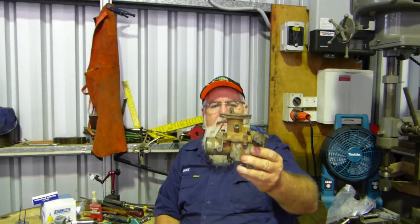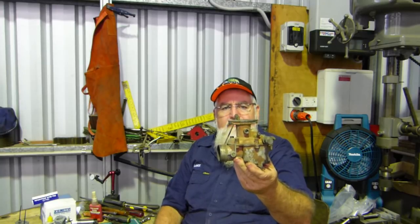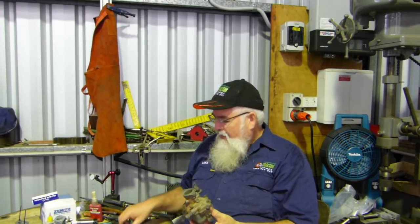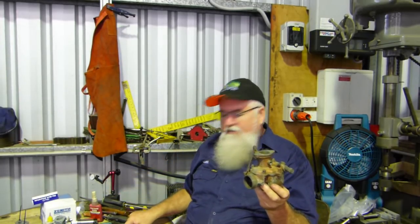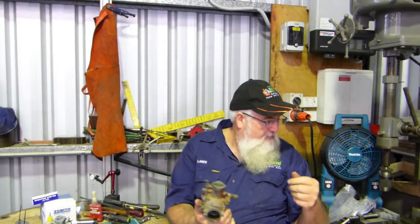This weekend I've mainly been doing this carby up and getting that ready. I have a 28G carby to do today — that's off a grey-and-gold Ferguson 35 petrol. Today we're boring out the housing on this little plate I made, boring to 5/16th roughly. I might start changing that to 8mm and then ream to exact shaft size. I may also get the Morse taper done today — get the thread in and get that up and running. We'll just see how we go for time.